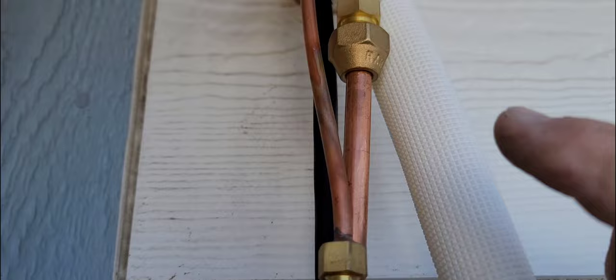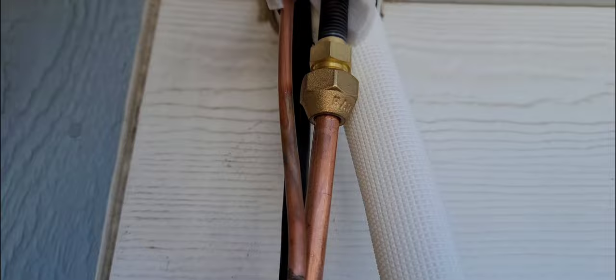When I go to set it up and put the pump up, I leave this one here loose a little bit. That way I can see it suctioning — I know it's actually working. You can see your gauges are correct; you can tell it's working because it's sucking air. I leave this loose so it's sucking air out of there, and you can see it on the pump and on the gauges.